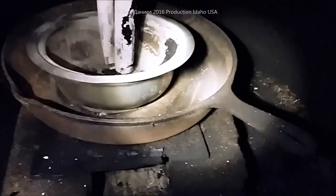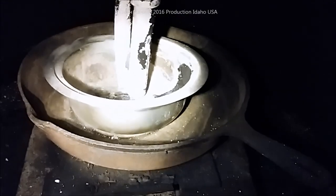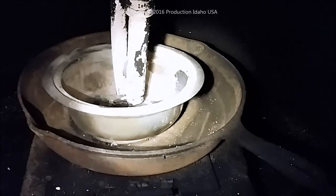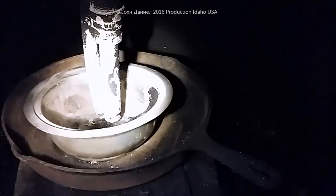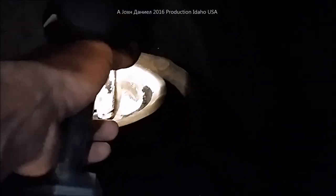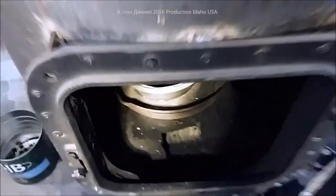I have a big cast iron, 14-inch piece I put in the bottom, and that's just for safety. If there's any burn-through of the stainless, it'll just go to the cast iron — the flame will change, it makes a louder noise, and then I'll know to change it out. I buy these as dog bowls from D&B, Tractor Supply, or Menards for about six bucks.